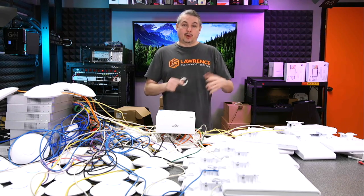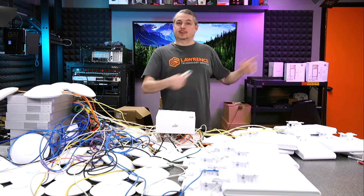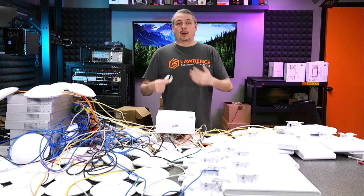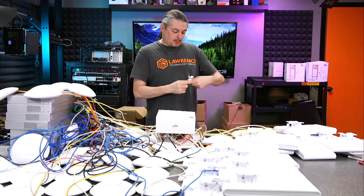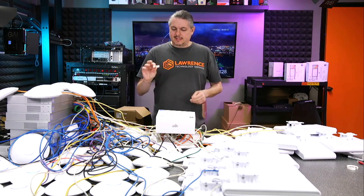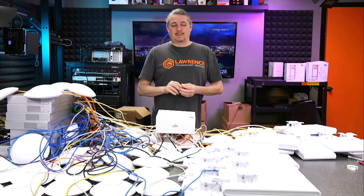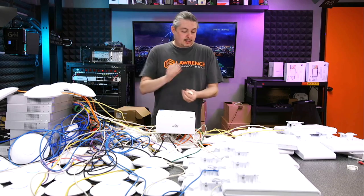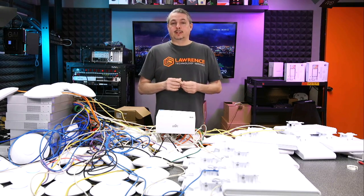The first project is done. The next project is another warehouse owned by the same company, which has its own internal IT team. Here are our pre-deployment steps: we get all units set up and adopted — it looks messy but it's temporary; they took over my studio because there wasn't enough room in the tech area. Once they're all adopted, upgraded, and planned on our internal controller, we deploy them. We label each one — this setup has 16 mesh pros and 62 AP LRs. Each unit gets a sticker with a corresponding label in the UniFi controller. We have a schematic and hand these to contractors who mount and label each one in the ceiling.